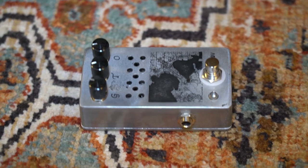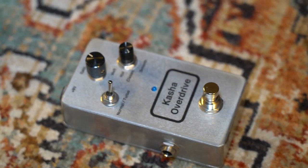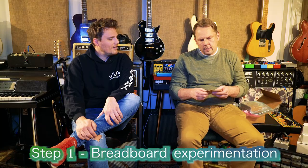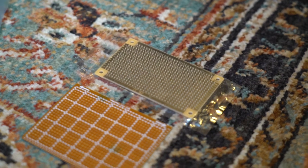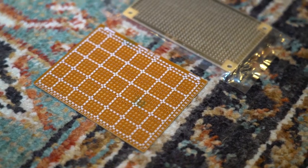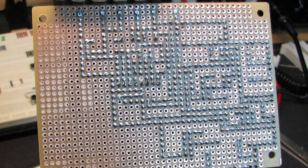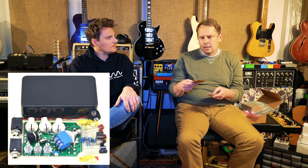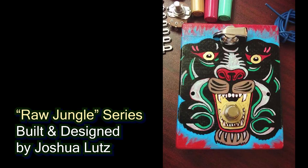What did you bring us today? He brought a ton of little surprises. So I kind of went through my collection and found some pieces. As I was digging through it, I thought to myself, wow, this has really been a journey of pedal building — some of the things that evolved personally in my skill set as I started building. The first entry: breadboards. There are actually two different types. There's what they call a Vero board — basically point to point. Each pad is individually isolated from its neighbor, and you make connections by soldering the component legs after fitting through. There's a collection of layouts available online, so you can spend a couple bucks, buy a handful of resistors, and make a circuit that makes noises — after a few attempts, because it's pretty easy to make mistakes with something like this.